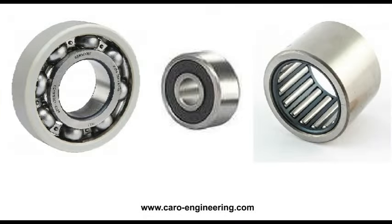Ball bearings provide the smoothest, lowest drag movement without the potential for play, so they are a great choice for ailerons and elevators. Sealed bearings are best because the grease stays in and the dust out. This is a maintenance-free solution for a long time and has very low wear. The upfront cost is fairly high, but that is more than saved in time and hassle over the life of the airplane compared to bushings or open bearings.